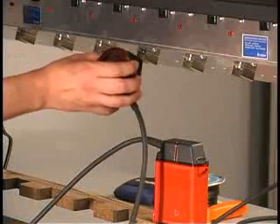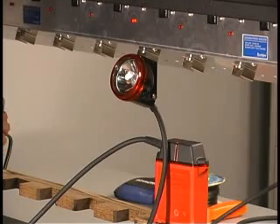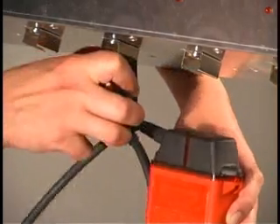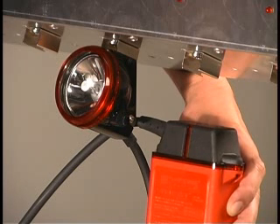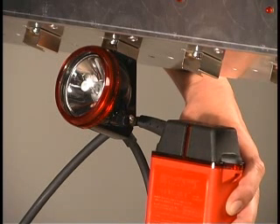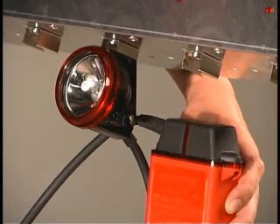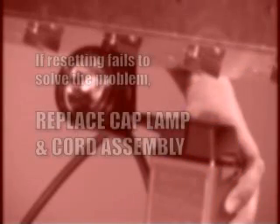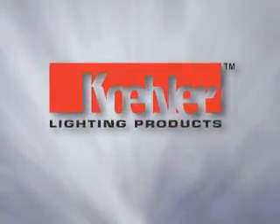Should the LI-16 short circuit, you may reset the unit by merely placing it into the charger. You will see three fast flashes on the red light at the top of the battery. This will reset the battery and the cap lamp should operate as intended. If all else fails, replacing the cap lamp and cord assembly with a new one may solve the problem.